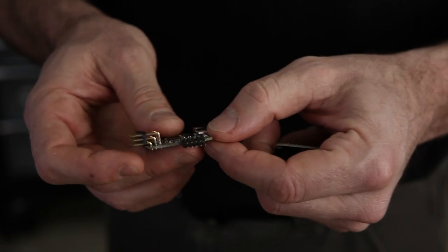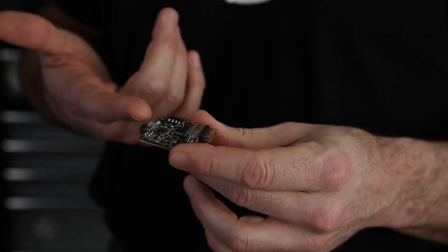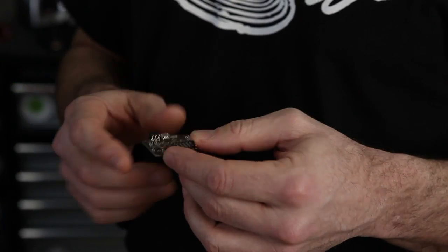Thanks to Peter, we're all set up with our pins and ready to start mounting. The first thing we'll do is get a USB cable and plug into the board's port to flash it with CleanFlight — or BaseFlight if you prefer. The nice thing is this is actually an application on Google Chrome, so there are no more crazy extracted files. Both BaseFlight and CleanFlight are available right in the Chrome app store, very easy to use.